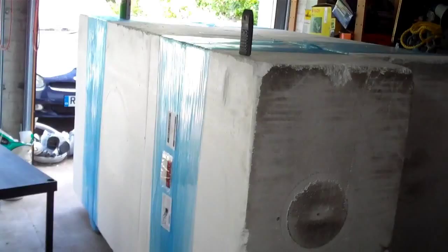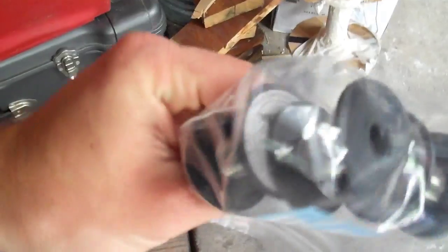First, we ordered a huge block of polystyrene. The reason we didn't order it pre-cut and pre-made was because the quotes were sky high — about fifteen hundred pounds to manufacture it to our personal specifications. So we ordered a big block of packaging polystyrene: 8 foot by 4 foot by 2 foot, figuring we'd cut it ourselves. The traditional way to cut polystyrene is with a hot wire cutter using nichrome wire — the same material found in a toaster that goes orange when heated. For our large block, we needed a longer length of nichrome wire, which required passing a much bigger current through it.